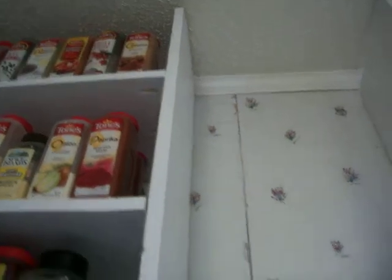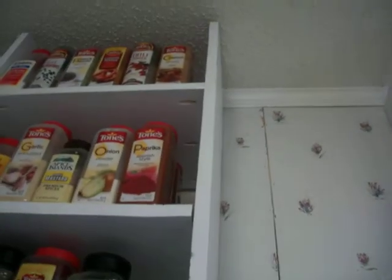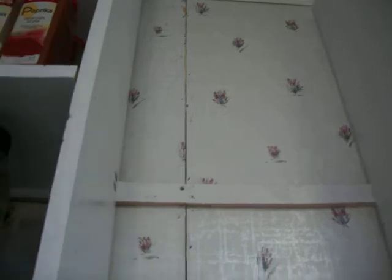So these cabinets, I know I cut these boards 50 and a half inches is what the new boards are. So they're a little short, but I didn't have to worry about cutting the angles off of them like I did these two, because they were fine in the back, but they were hitting the ceiling at the front. So I went ahead and cut them at a 15 degree angle. And I even thought about putting another strip a little further up, but I don't think that's necessary. But if I can, I mean, there's room.